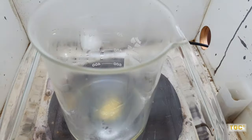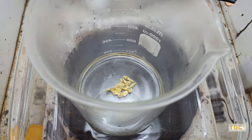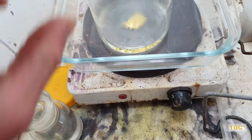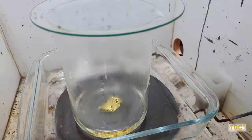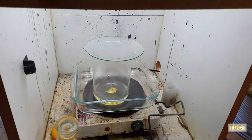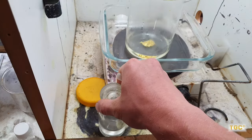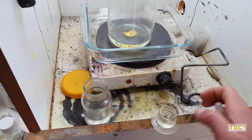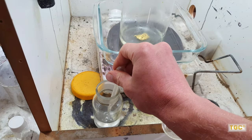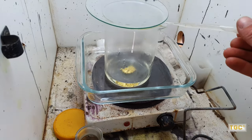It's been sitting in the hydrochloric acid for a little while now, and all the gold looks very similar in colour, which is good. So it might have worked correctly — it's just that some of it might have had some other crap on the outside from when I poured it. So we can probably add a little bit of nitric now, I reckon.